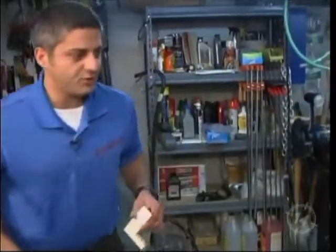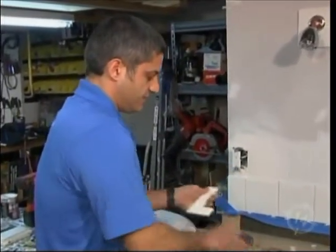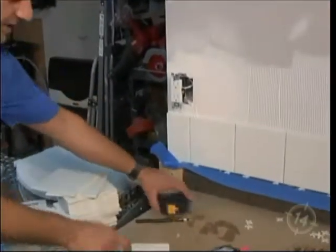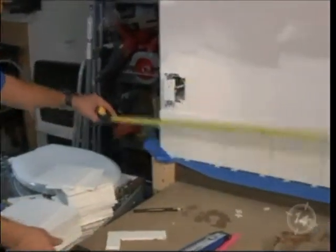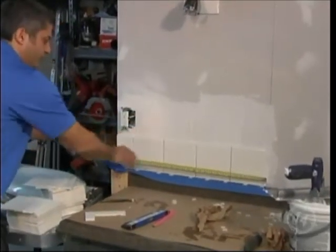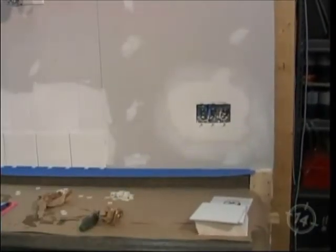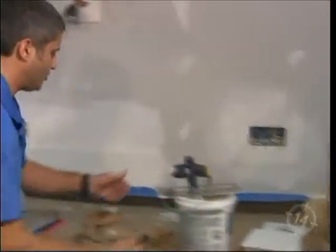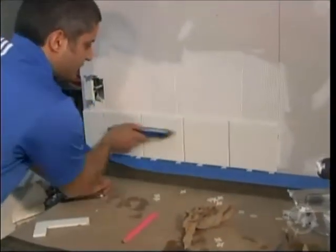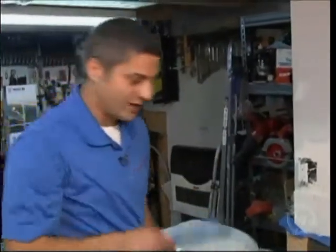Let's show you where we're going to use our L-cut. Before the break, we ended here. We put in this cut because, remember Hamilton, we divided the wall in half. Full, full, full, full — half. You finish your wall going the other way: full, full, full — half. You've got a perfectly matching wall. Also very important — use the level, run it left and right. Nothing's banging, nothing's jogging, nothing's jumping. A perfect tile job, as it should be.